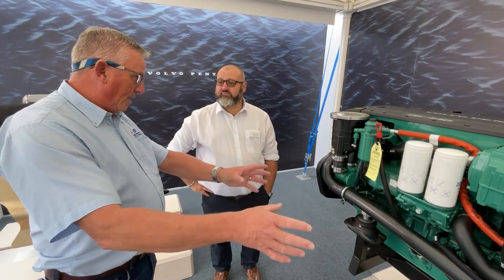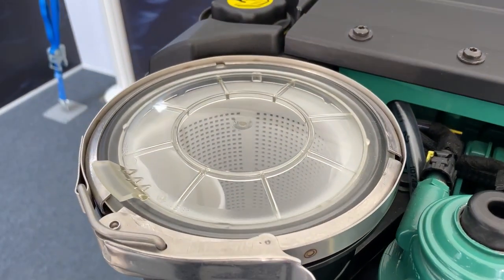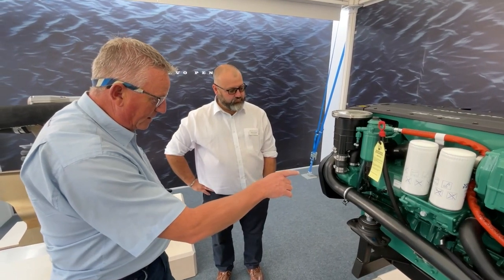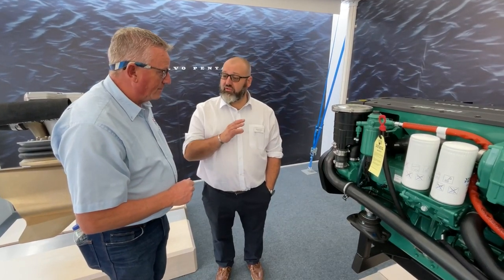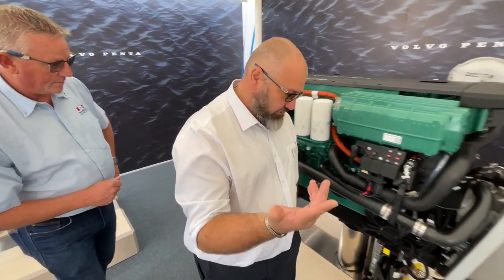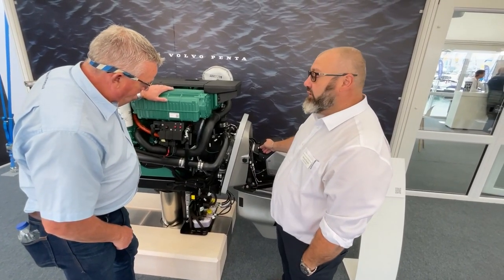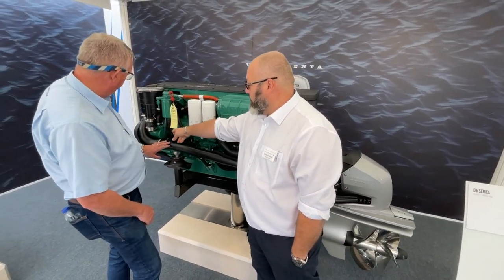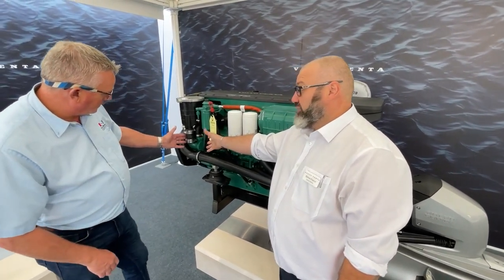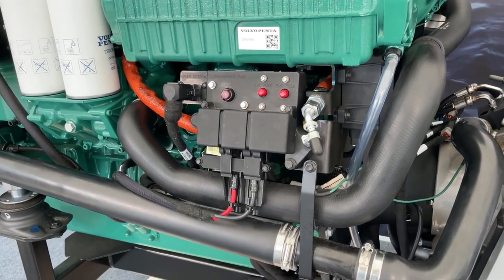The principles are indirect cooling, and I notice you've got the water intake coming up to quite a large strainer on the front which is nice and visible. With this particular model we've got an aqua drive, so we're taking water up through the drive keeping the drive cooled. The bottom half through the drive itself has a drain-down nipple for the salt water cooling circuit. It's an impeller-driven pump as per standard marine applications, and along here you've got some quite large coolers with anodes tucked away as well.